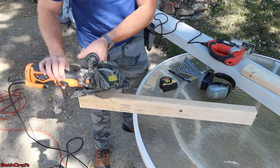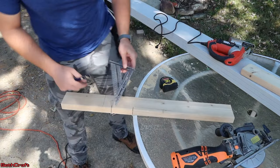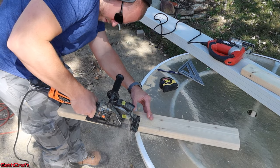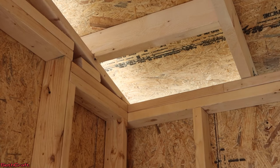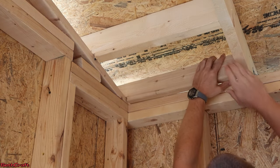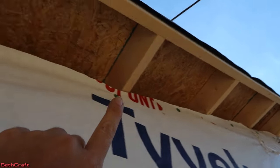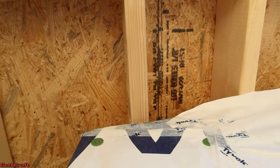I'm going to set the depth of my saw to three quarter inch. To hopefully save a little bit of time I'm going to plunge cut into the wood here with my circular saw. Let's go ahead and get this board through here and see how we did on our cuts. The soffit that goes from up here down this way will now end just slightly off from this board, so that just gives us a surface to nail to on the end.